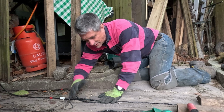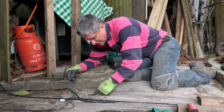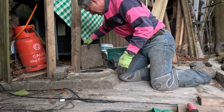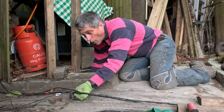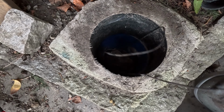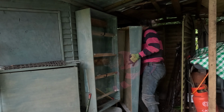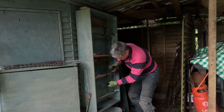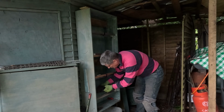As the cable bundles get to this transfer point, they need to bend round and go down. There are some little holes here I'll have to clean out, down into here. And there are already a few cables. See, there. In fact, one of them I don't need to keep anymore, but they're handy to leave for the moment. So there we are. Let's have another look in here. So that's the pull string I put in before, so I can use that to pull new cables through. Brilliant.